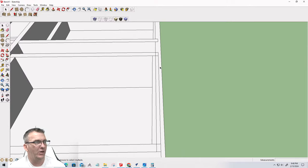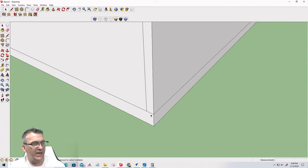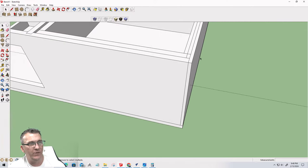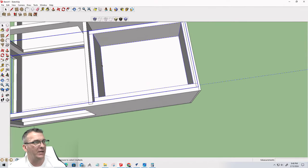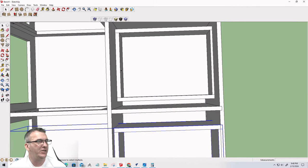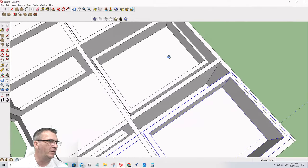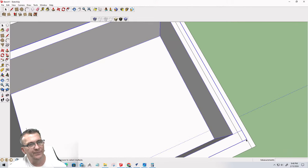And now what that shows me, because I was going to the flush of everything, it shows me my wrong thinking. So my front face goes in here, right? Flush with the front, not my drawer. My drawer front's there. This is 3/4. But my drawer, I don't have the clearance on the back, so I actually got to bring it in some. On that one, I should be good on those still. But let's find out.